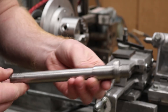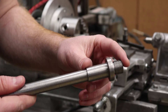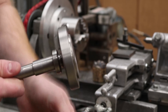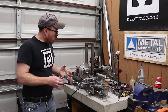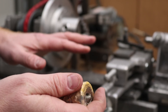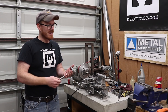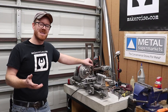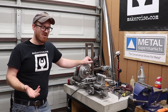Bob also turned this spindle for me — he turned it to the dimensions in the Gingery books. It's got a 3/4-inch threaded end, a 3/4-inch bearing surface for the right side of the headstock, as well as a 5/8-inch shaft for the pulleys. It would be a drop-in replacement, but the bearings I've got are worn, so I'll need to turn replacement bearings. Enter the chuck and the ability to quickly turn down bronze bushings for this improved spindle — I'm pretty excited, and hopefully it'll help me get a lot more mileage out of this lathe. I hope this project builds your confidence to exercise your inner maker. If you like the video, click like, and if you really like the project, consider subscribing — thanks for watching.